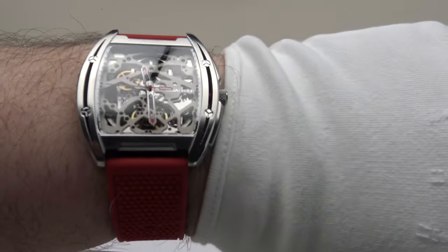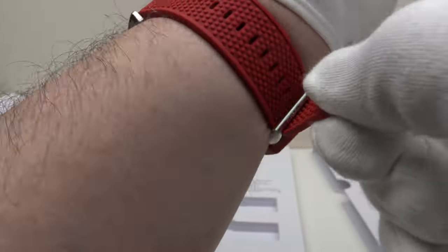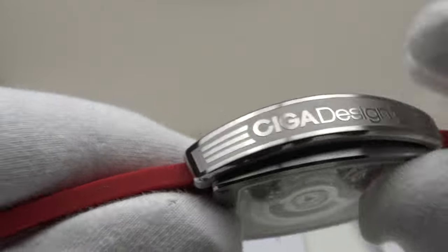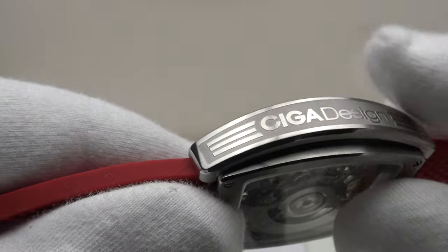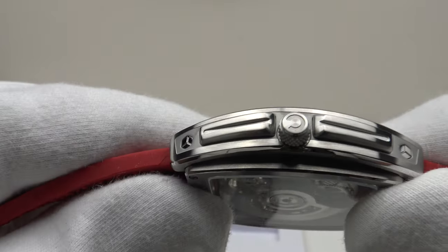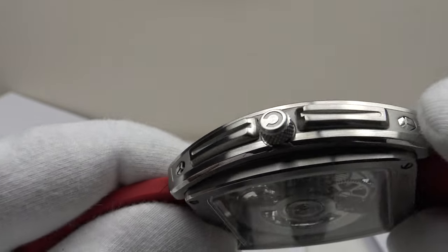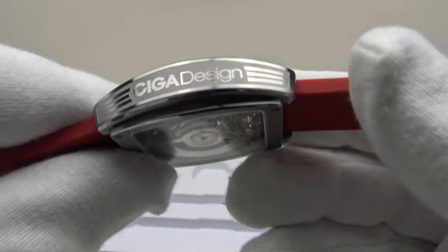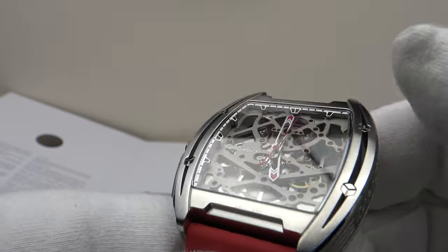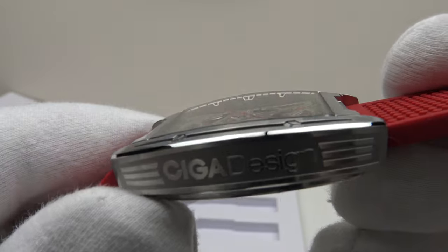It's a good looking piece and I like the quality of the finishing — brush satin finishing to the top side, underside of the case and also on the flanks, with nice attention to detail on both sides of the flanks. Siga Design is embossed and the quality of the finishing to the head of the piece is really exceptional. Very good quality brush satin finishing which contrasts with the matte bead blasted effect of the background. On the other flank we have ridges — it's a very well finished case. Even the heads of the screws are finished very well. There's a nice mirror polished bevel machined on the edge of the case marking the transition between the top of the case and the flanks.